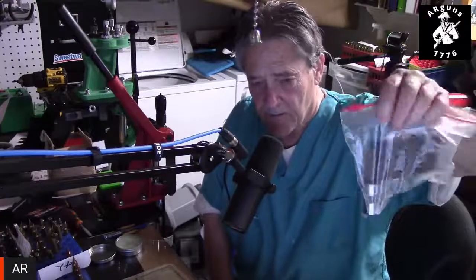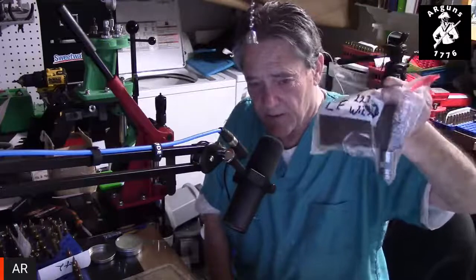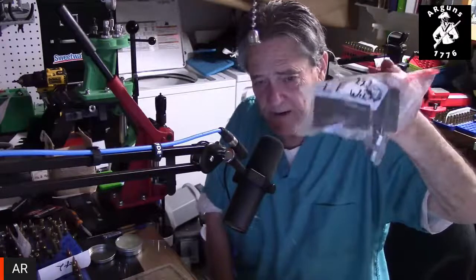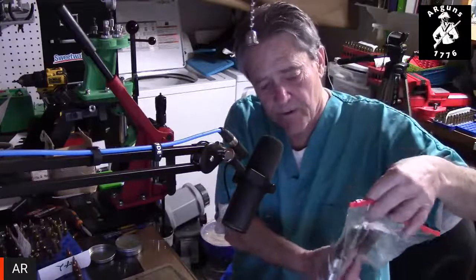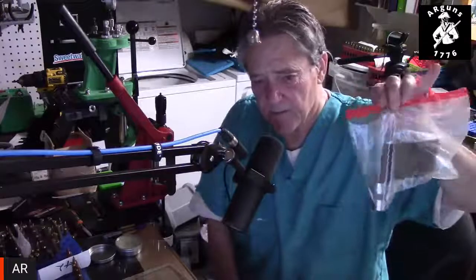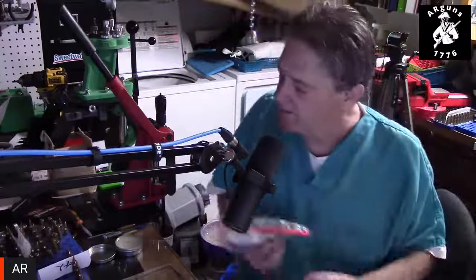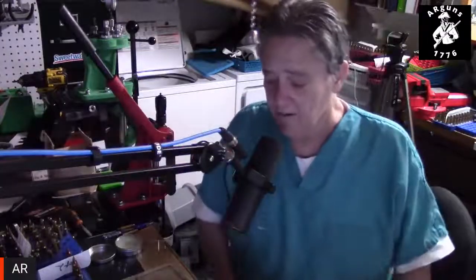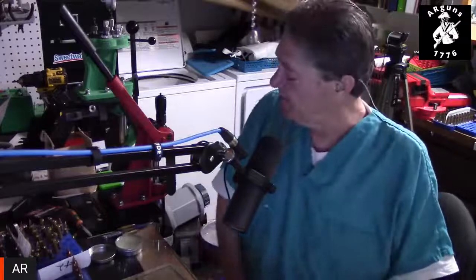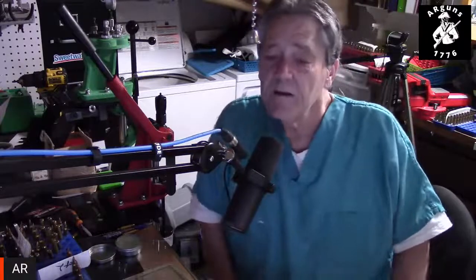And spray WD-40 in it, and I have never had rust the past several years. And occasionally I replenish a little bit of spray on the cardboard. Put your little corrugated box in a baggie, freezer bag. Wipe your thing down, stick it in there, and you never have to worry about rust. So I got that idea from him, so I'll give him the credit. That's where I learned it from.